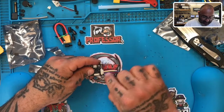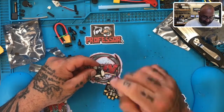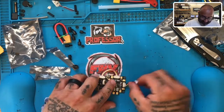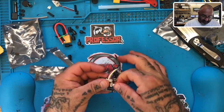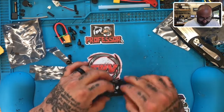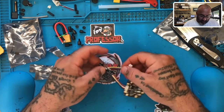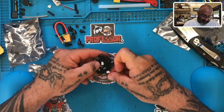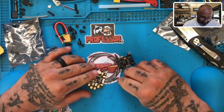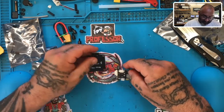So if you're coming from your ESC, you need to make sure that you do not plug your 12 volt, VBAT, or whatever it may be, where the red wire goes — instead that needs to go over here. You can either cut this cable on this end and plug it into your board, then remove the other end. If you look at the wiring on the back it tells you: battery, current, 12 volt, and ground. So you'll have ground, 12 volt, current, and then direct VBAT right here. I'm going to test this out quickly to confirm that's right.